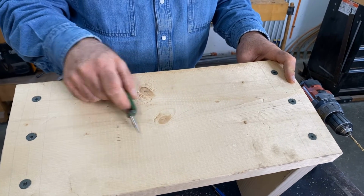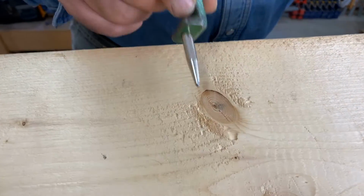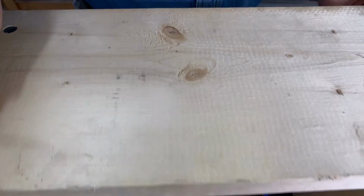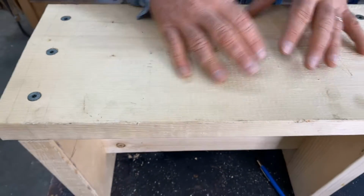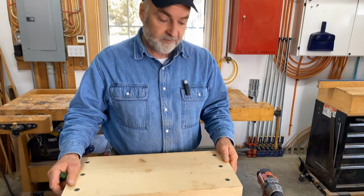So we got that. We've got some tearing of the wood here. The grain was running in one direction and the thickness planer was running in the other, so it caused that tearing. It's dirty. Some of the corners are dented a little bit. This is all completely normal, by the way. We didn't do any mistakes, and if your footstool looks like this, you didn't do any mistakes either. This is just the way lumber looks until you refine it.